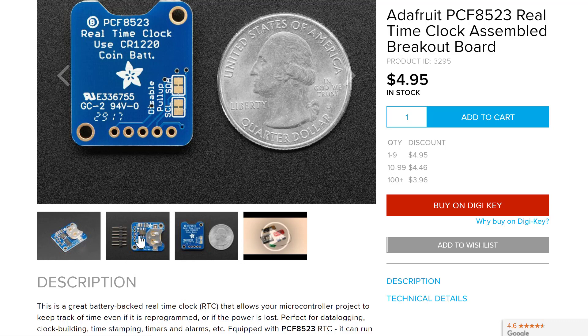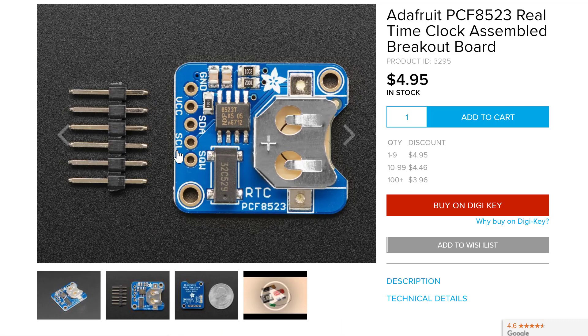You can see right away there are five pins: ground and power, SDA — I recognize that — SCL, and something else, SQW, which I don't know what it is and I'm not going to use it. The way it works with power is you can power this off a coin cell battery, or you can provide power from the pin. What we'll do when we write our code is grab ground and VCC from the MSP430 LaunchPad board and jump over to these two lines, so we'll bring in four wires total to power this and communicate with it.